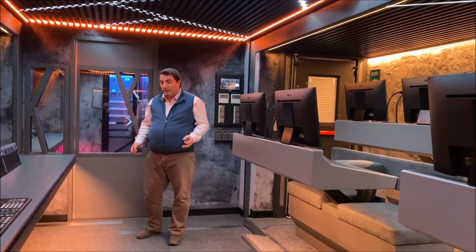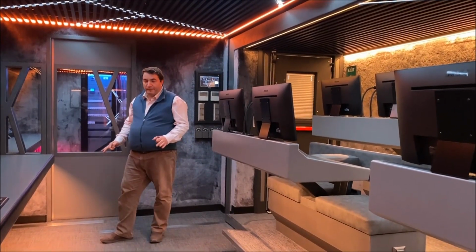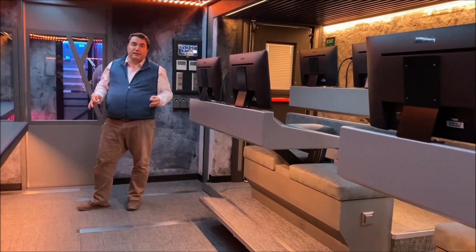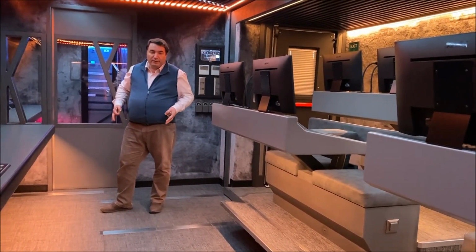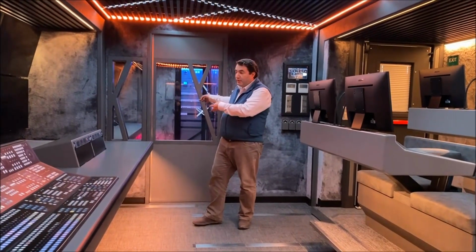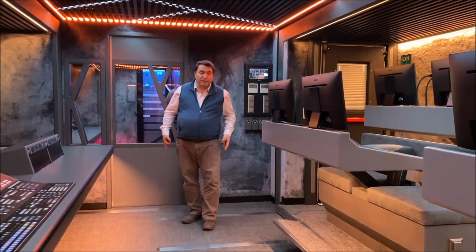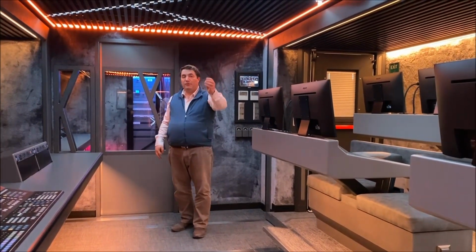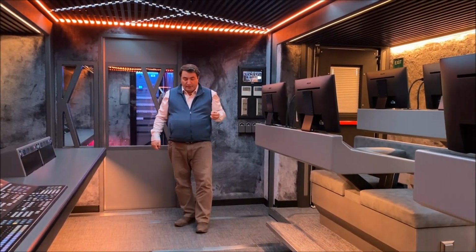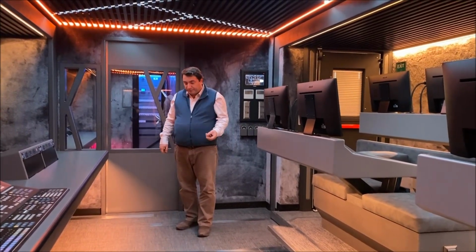So what we do is we are actually standing on top of a raised floor. The whole floor from front to back is raised by roughly 10 centimeters, and we have our main cable raceways starting from the power distribution panel, going into the racks, going into the cable pallets to the expansions, and running through the main shaft, going all the way to the audio room, and also reaching the TP area. To access these, we have some access panels.